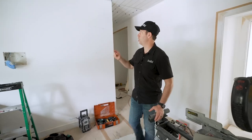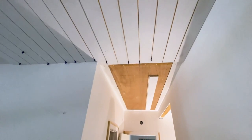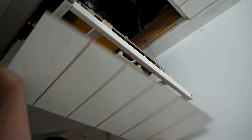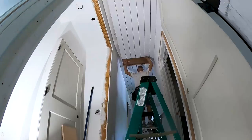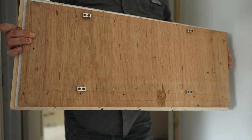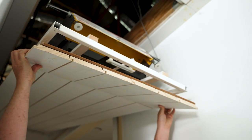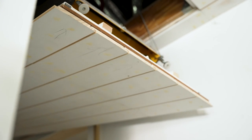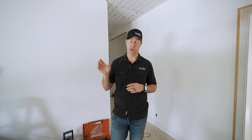I do want to mention one last thing — we had to spend a little bit of time on this panel right here. There's a slit in the wood and about a quarter-inch gap. That panel is so we can take it down if we ever need to interact with the staircase in manual mode. If the motor or power went out, we take that panel down — there are cotter pins in there. We can pull those and the staircase would drop down on its own weight, so it's kind of an emergency setting. It was difficult to get all the details worked out, but Carlos and Toke did an amazing job. You could do this on one of your jobs as well.